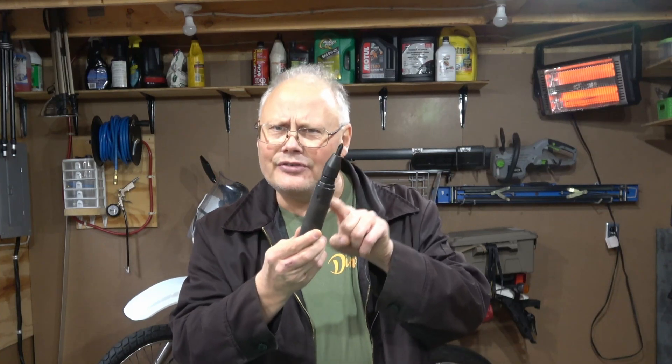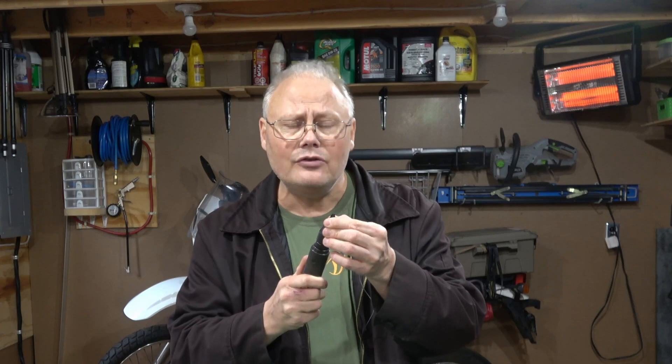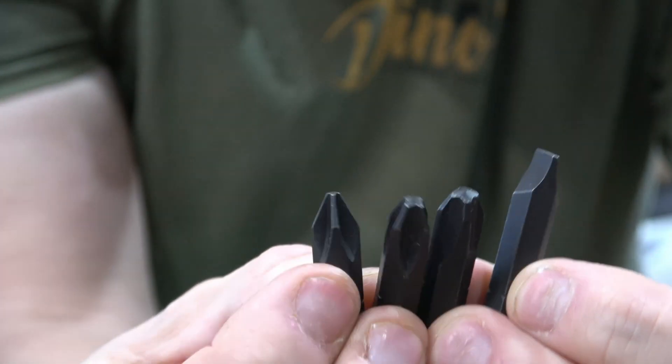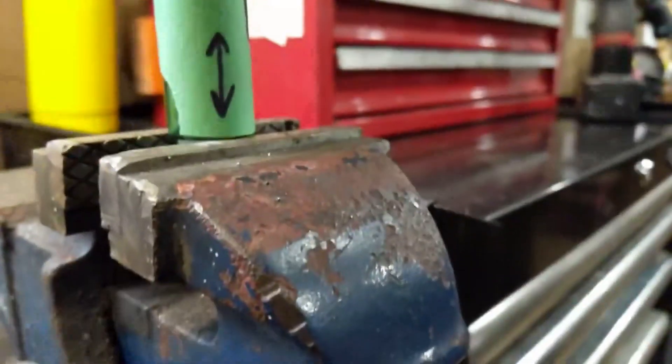Stepping up from the center punch is what's known as a manual impact driver. I've owned one of these probably since the mid-1980s and my first Honda 50 minibike. The way these work is there is an internal ramp system — you hold it against the fastener and hit it with your hammer. As the main body is driven in, it rotates the tip, thus loosening your fastener. These are really inexpensive, very portable, and they usually come with an assortment of screwdriver tips for Phillips and flathead fasteners. The fact that you're pushing in as it turns keeps the screw tip bit locked right inside the fastener.